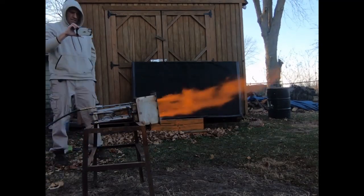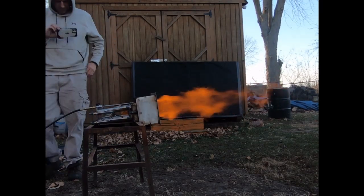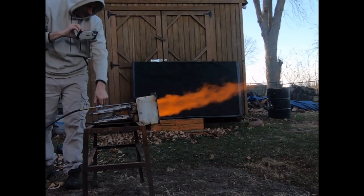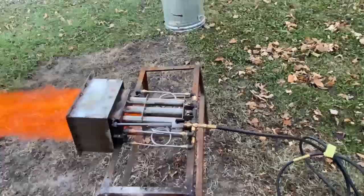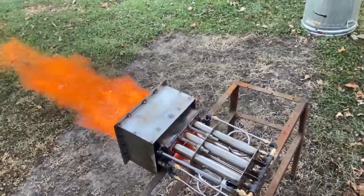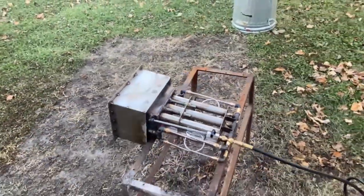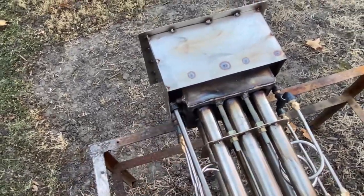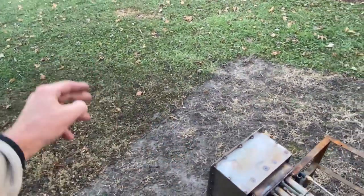Pretty nice, though. I'm very happy with the performance of this thing. It worked out great. That nozzle end could also be made out of a silicon carbide convergent tube. So it's still shooting a little bit of flame back when it's on super low. Moving this stack forward definitely helped all that backfire we were getting, and some very strange combustion oscillations were taking place.